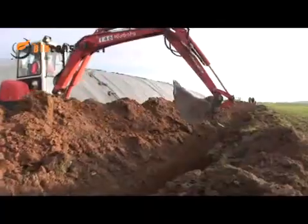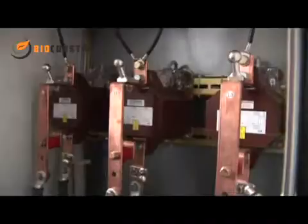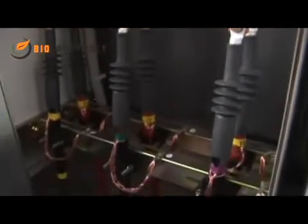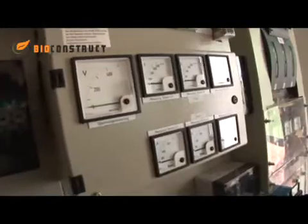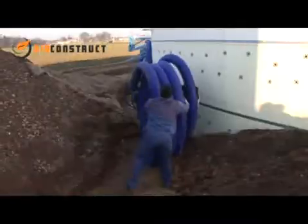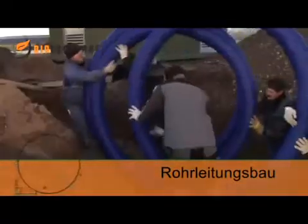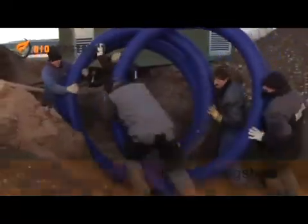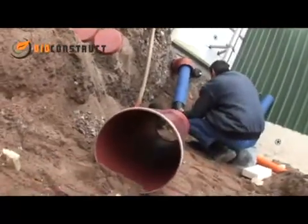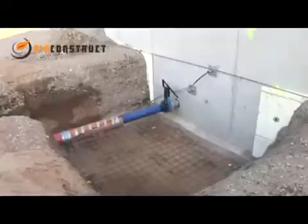We can also provide services over and above the construction of the actual plant. Our expertise encompasses grid connection, biomethane supply, micro-gas distribution systems, optimal energy recovery and heating networks. Here you can see the laying of a local heating system. The subsurface feedstock pipes used in this biogas plant are jacketed pipes with leakage control and meet the highest safety standards.